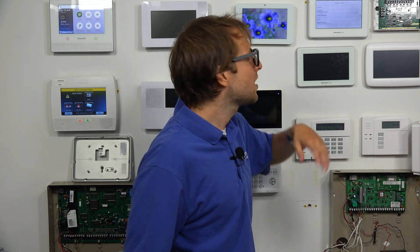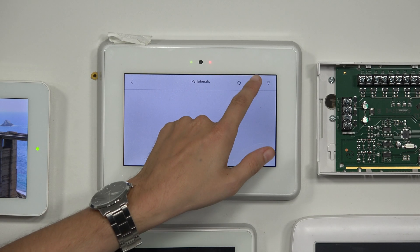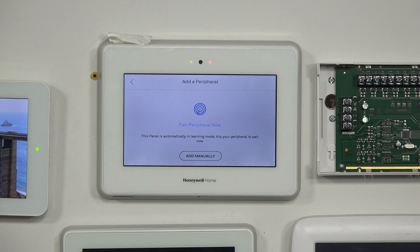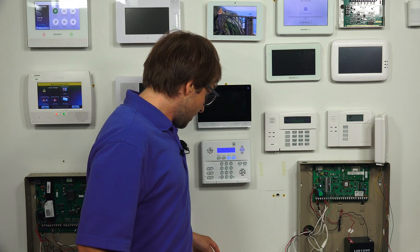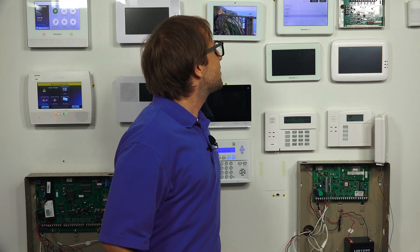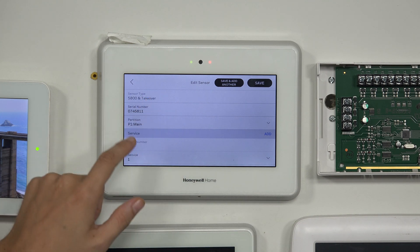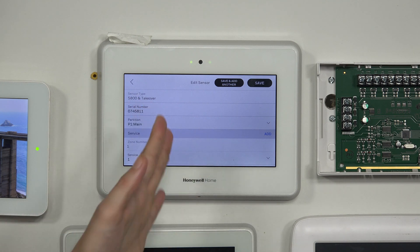If you have a Pro A7 or Pro A7 C, you will need to install the Pro Wi-Fi ZW or the Pro Wi-Fi without Z-Wave control. Make sure you have Wi-Fi, a charged backup battery, no AC loss condition, and that the panel is powered on, monitored, and connected to Wi-Fi. We're going to choose Peripherals. At the peripheral screen, press the plus button in the upper right corner to get to the add a peripheral screen where we can auto-enroll the Honeywell 5800 Mini. We faulted it and got it to enroll on the first try. You see the sensor type reads '5800 and takeover' — this is a legacy sensor using the Pro Takeover module. The serial number has been auto-enrolled; you can check it on your sensor to confirm.